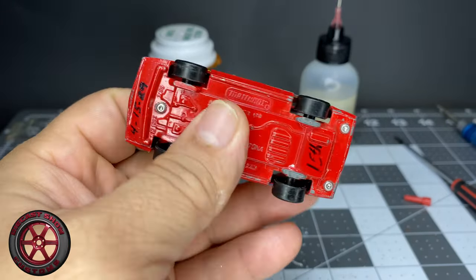If you go with the M2 screw, it sits in between the 1-72 and the 2-56. But you have a lot more options, and the 1-72 and the 2-56 screws are way cheaper than the M2 by 3mm and M2 by 4mm. So if you're already ordering online, I'd much rather do the 1-72 and the 2-56. The taps are cheaper. Everything is cheaper on the other side. So let's jump to the other section of this video.